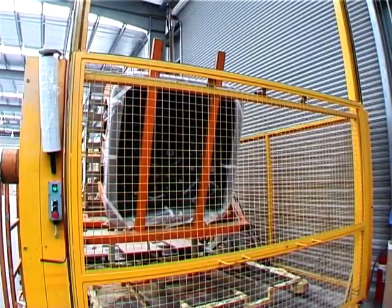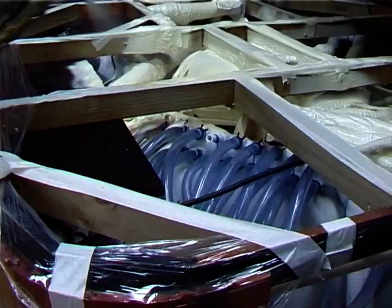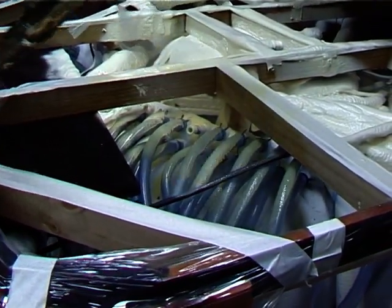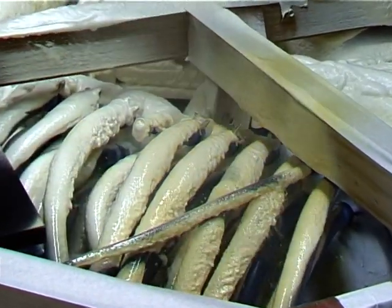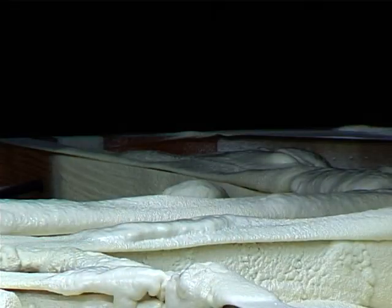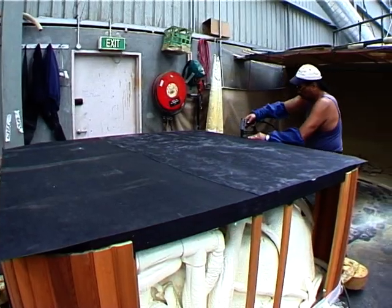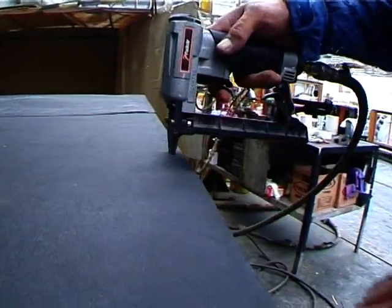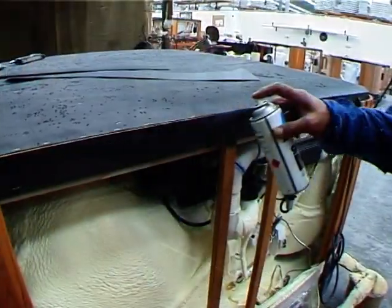The water is then drained, the spar flipped, and foam applied to the pipes. This thick layer of foam performs two important functions. Firstly, it insulates the pipes to reduce heat loss, and also holds them in place to prevent movement whilst the spar is in operation. A durable ABS base is stapled to the structure, then trimmed, and the kickboard is detailed in black.